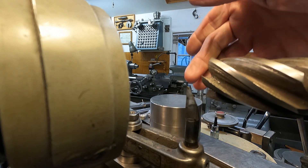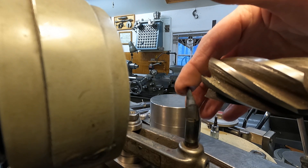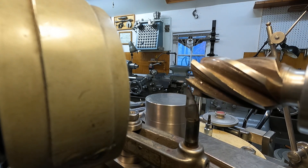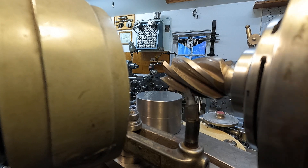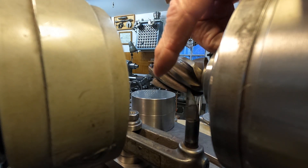This is a grinding finger here, or a tooth rest. So if you're going to grind this thing, you adjust that and put it on the tooth rest. Put a little tension on it, then advance the table. Put a little tension on the work head. Now I'm going to go forward — so that would grind that face.